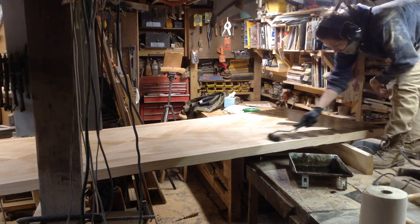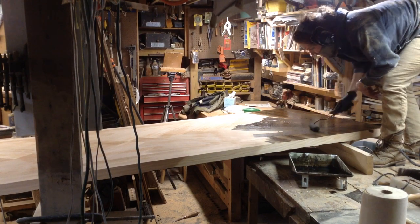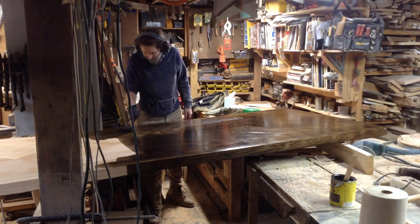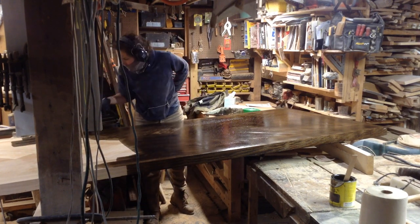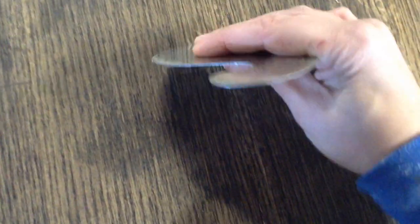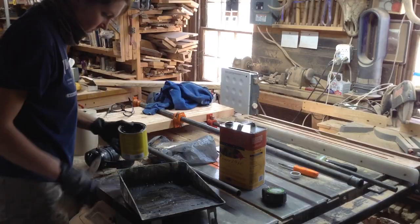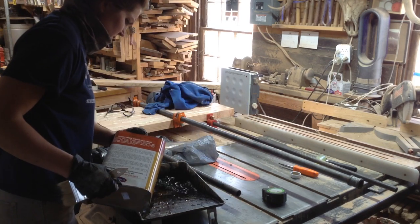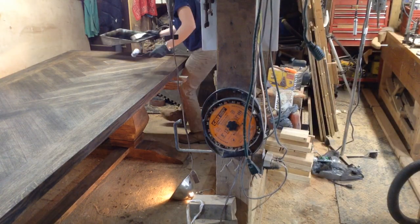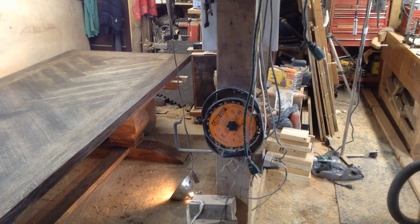Then I go through and put the stain on. I used a lot of rollers for this because it was such a large surface area — it just made the process go by much quicker. What I like to do is use a roller and then go through with a brush to clean up the roller marks. This is Varathane Jacobean stain. I put it on all the pieces. I sanded the heck out of this top but I still had residue from that veneer tape, which frustrated me because I couldn't see it until I put the stain on. To fix that I used a card scraper — it removed all the residue. I re-spot stained those parts and it matched perfectly. If you're a first-time user of that tape, just a heads up: it doesn't show that it's on there but it stays on pretty well. I probably just should have used a card scraper on the whole surface from the start.